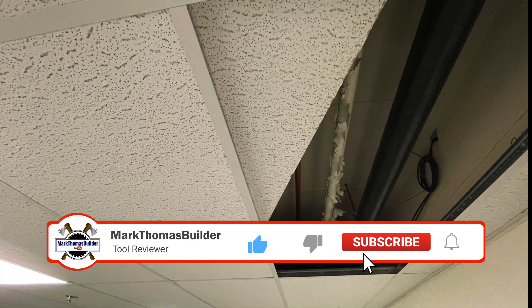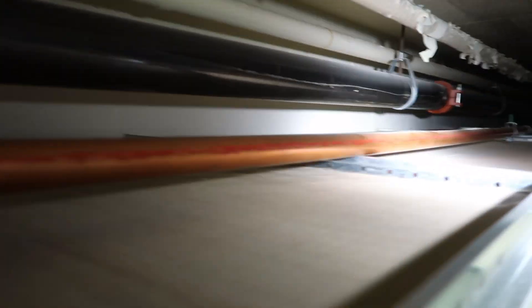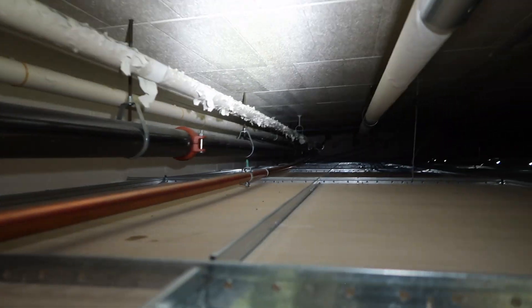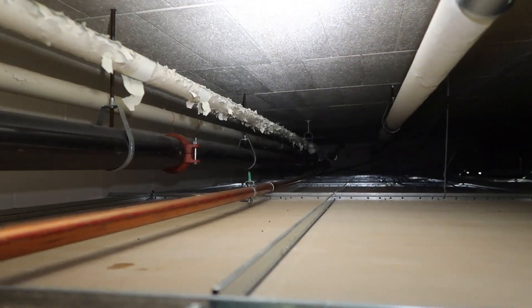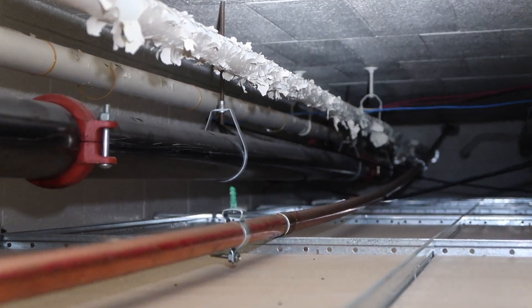Let's take a look above this suspended ceiling. This is in a commercial building and we have some one-inch copper line — that's a water line right there. The copper line is sitting right on top of the suspended ceiling. There are some anchors you can see that had pulled out from the ceiling up there, and the water line was lucky that nothing broke. It's dropping down about 20 inches or so, so I'll show you how I reinforce this with some new anchors in the concrete.